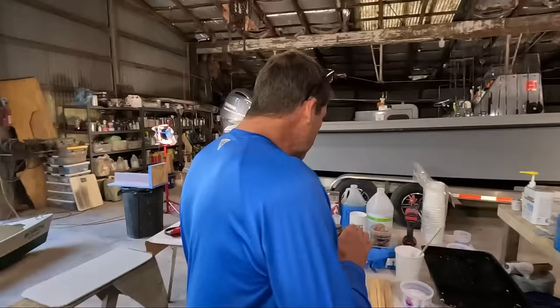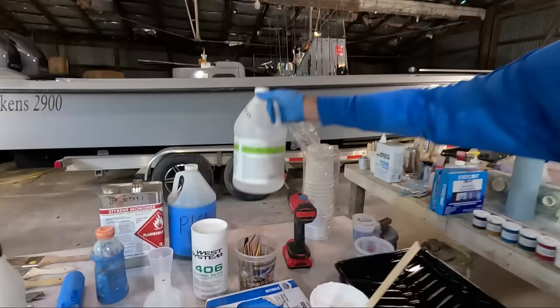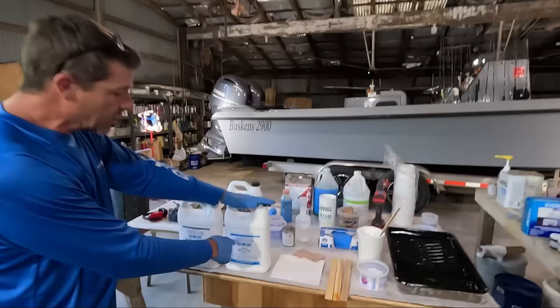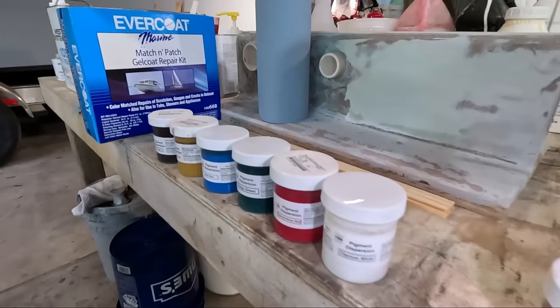I'm going to put some PPE on, get some gloves on, and show a quick overview of how we would add modifier C to some gel coat and how we would activate or catalyze it. It is very important to remember we're going to be using MEKP — methyl ethyl ketone peroxide — as your activator or hardener. Gel coat is not like house paint or automotive paint; it is basically a high-caliber boat resin with pigment added. You can get a base white gel coat and add an assortment of pigments to tint it to different colors, and there are gel coat match kits available from various suppliers.